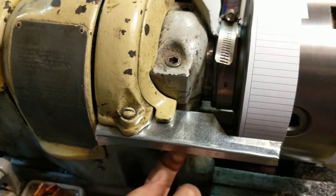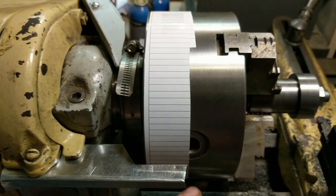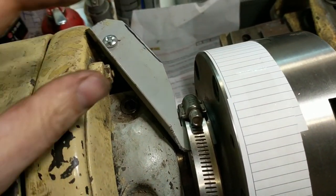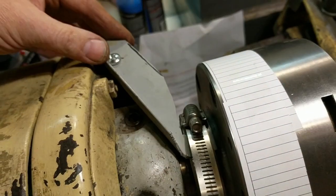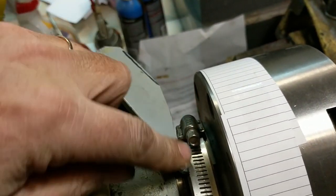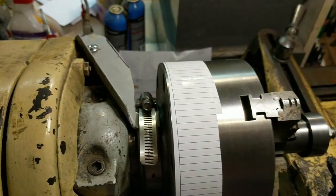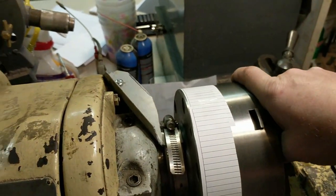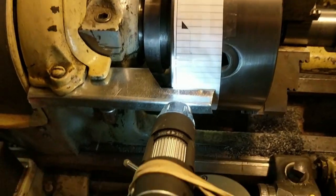So I will build some kind of pointing finger. I took this cover off and cut this piece of sheet metal — it's bent here and at the back so it's U-shaped, which gives it decent rigidity. Then I took a slightly heavier gauge flat steel and cut it out on the band saw. It has an ear that sits up under this band clamp, acting as a spindle lock — it's tight here, and when I tighten this, the spindle can't move.